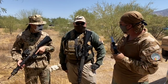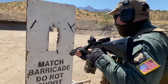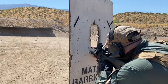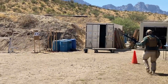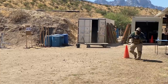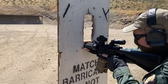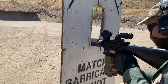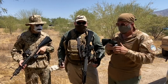So how did your build go today? Everything ran fine. I shot about 90 rounds through it before the match, torquing on the upper, putting pressure on the magazine, doing all sorts of different things to see if I could induce a malfunction from stresses on it. And with the buffer tube properly cleared out after reaming it, I couldn't do that. Perfectly fine cycling after I had it appropriately reamed out with all the flash removed. And like I said, as we have the parts now and we're working through processing these, we can figure out the optimum ways for making hundreds to thousands of these things now.